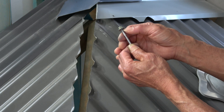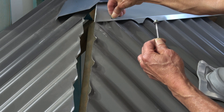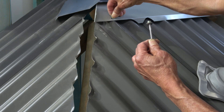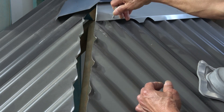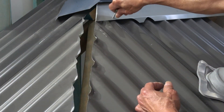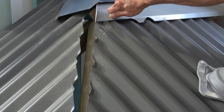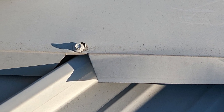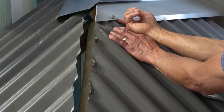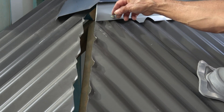It's a stabilizing thread, which is a smaller diameter than the main thread. You're relying on that to grip the two pieces of steel together and hold it for a long, long time. And that just doesn't happen — you can see how easy this is. Imagine a screw that you can do up by hand without a screw gun, how loose that is. So over time, this can actually pop, and you get an enlargement.